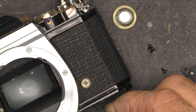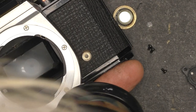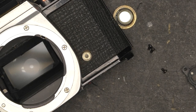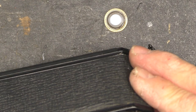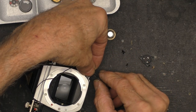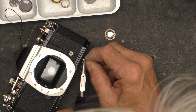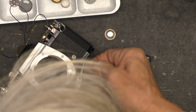Looking at it with a magnifying glass — oh man, it is really corroded. It's copper but it's turned black, absolutely corroded. This thing had a battery leak and it went bad. That may explain why there was corrosion up on the top as well. I think what I'll do is just twist it to the existing wire, because that will kind of hold it, then put a bit of super glue on it, hit it with the kicker, and then see if we can pull the whole mess up through here.